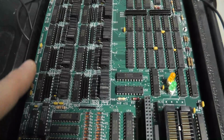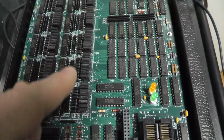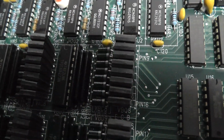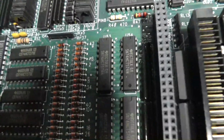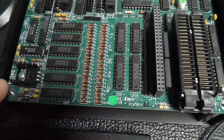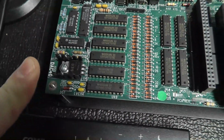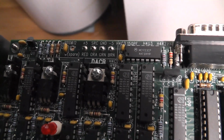And there's this column over here that's like VAC 32, and this is VBD 32. That's for the diodes, of course. And if I can zoom in there, it says like pin 9 through 16, pin 1 through 24, 25 through 32, 33 through 40, and 1 through 8. So in groups of 8 pins, they have all of these transistors, and then you have altogether 4 TIP41 transistors / amplifiers, which I assume is taking our -5 volts, our ground, probably source probably equals 12 volts, but I'm not sure. We'll put a voltmeter on here and find out.